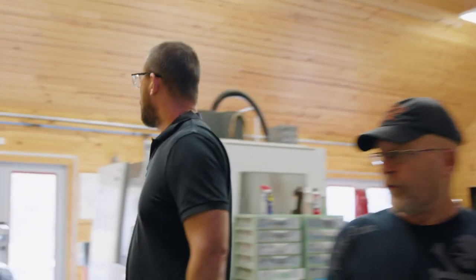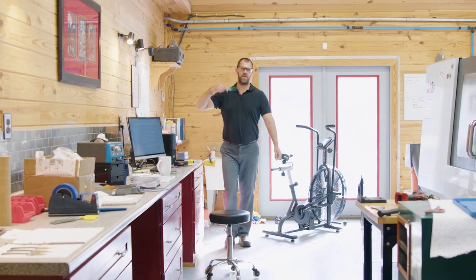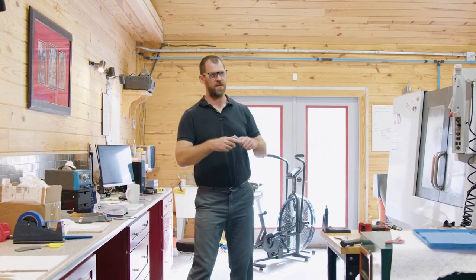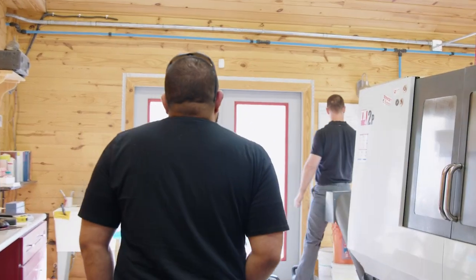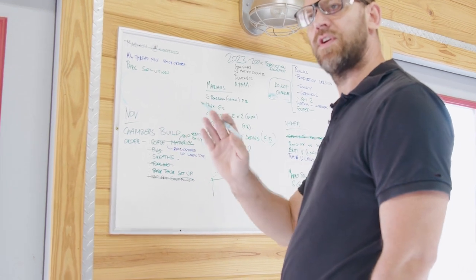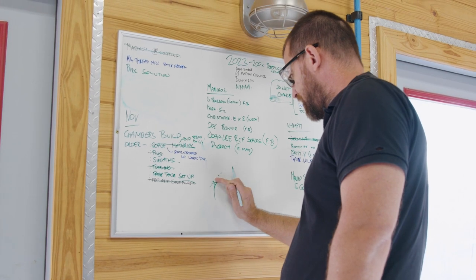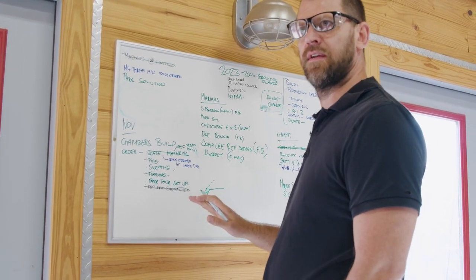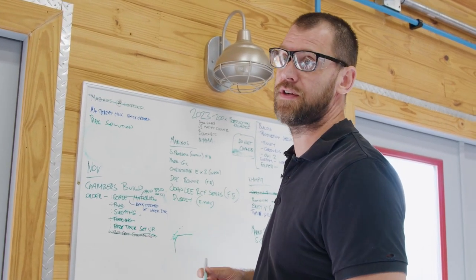If you have a square stone and work it over and over again, you're going to cut a radius into it and then it'll be good. But to start with, you're chasing the edge, creating steps — the edge will hump along, giving you a stagger instead of a clean finish. Eventually, the more you work that edge, you'll create a radius which gives you a nice clean edge. That's why radius stones and round rods are great — you already have the radius you're working with.